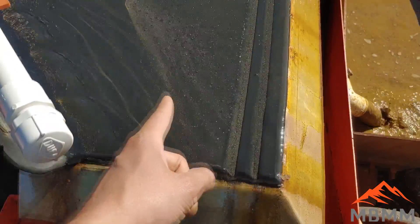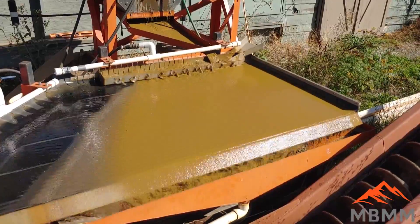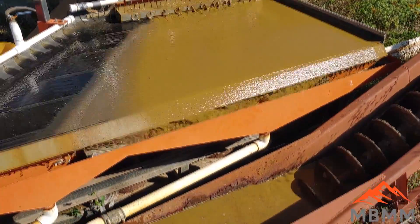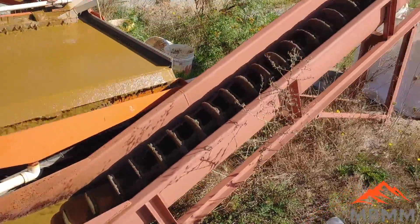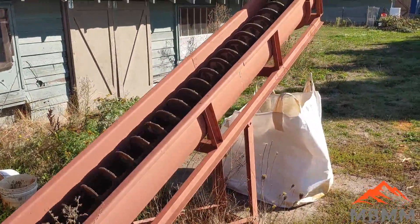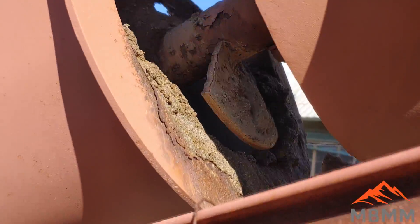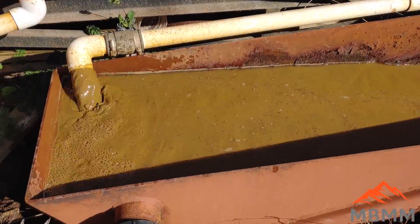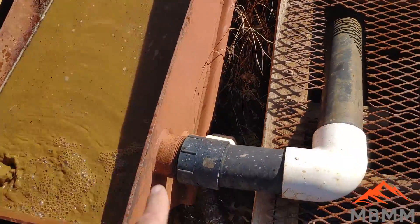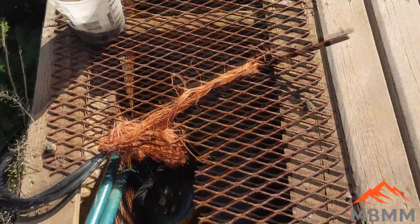The gold and all the high-grade concentrates come down into the number one and number two port. The quartz and other gangue minerals have a very low density, and so they are washed down into the tailings trough of the shaker table by the action of the shaking and the water. All the tailings report into this dewatering screw that augers the material up the trough and into a white holding bag. In this system the water is completely recirculated so there is no discharge into the environment.